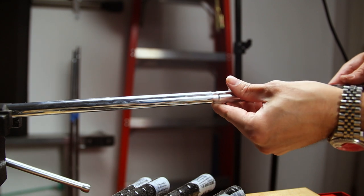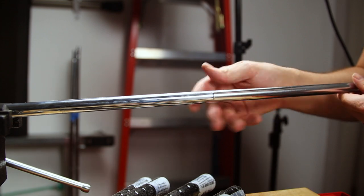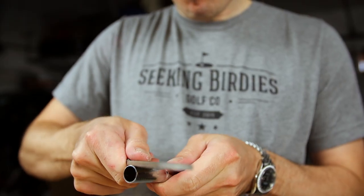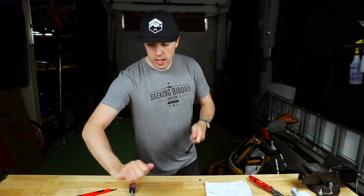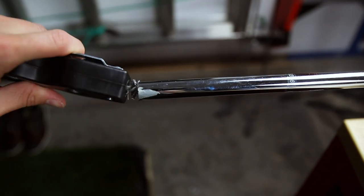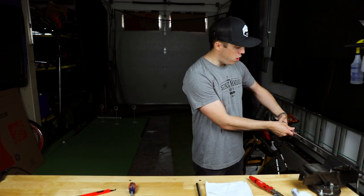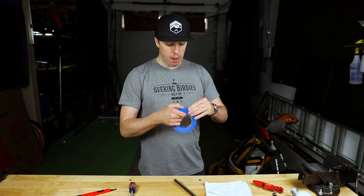This is a good time to take one of your extensions and test the fit to make sure you bought the proper ones. Before you get the epoxy out, you do have to do a little prep. I take a file and rough up any surface that's going to be epoxied. Then I get my wire brush and do the same thing to the shaft — crank it a few times to clean and roughen it up so the epoxy has something to grab onto.